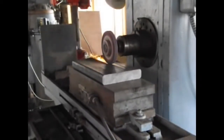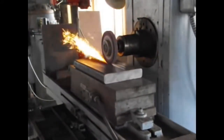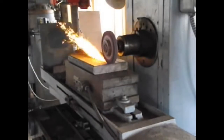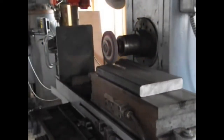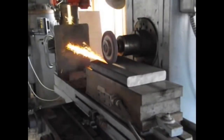Once you get the height, make horizontal passes across the material. When moving the material left and right, watch your speed to reduce wear — better slower than faster until you develop a feed-rate intuition. When moving the material back and forth, try to move the grinding wheel a distance just under its width in order to prevent uneven wear of the grinding wheel. Depending on the unevenness of your material, you may have to make multiple surface passes at lower and lower heights. Make sure that you surface grind the entire surface at a given height before lowering the grinding wheel more.